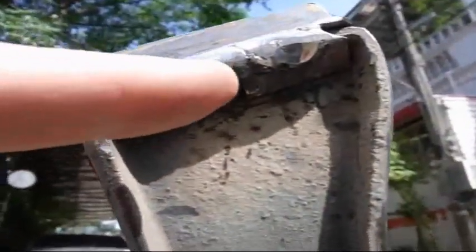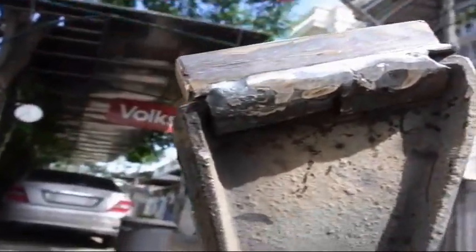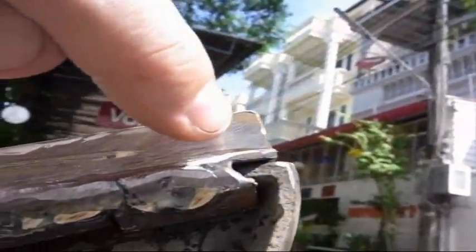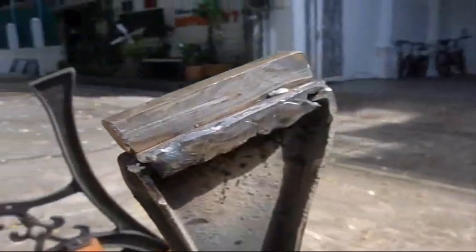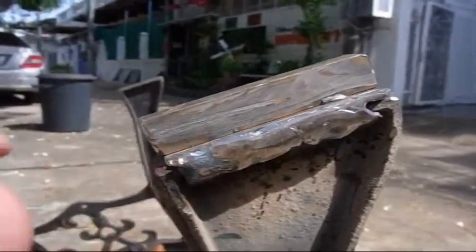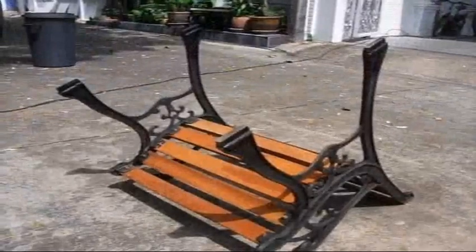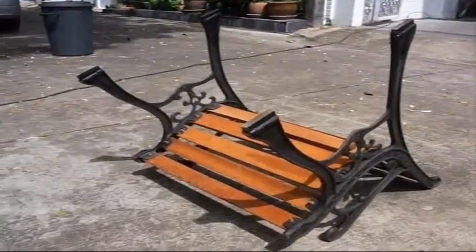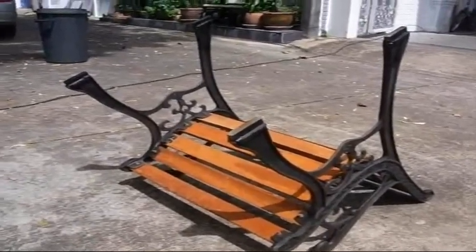So here we are. These two pieces are welded in underneath there, grabbing it in place like this. Here's our piece of metal we welded the stainless to, and I've got some more grinding to do. But there's the concept in practice — it's basically stainless steel welded onto a channel, or a boot if you will, that wraps around the chair leg. Here we are with all four feet in position. Spray paint to cover some sins. Let's flip her over and see how it works.